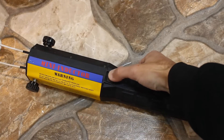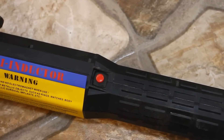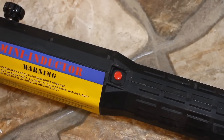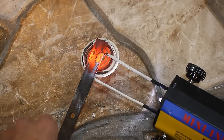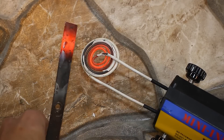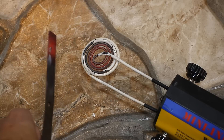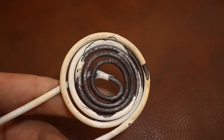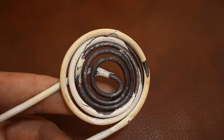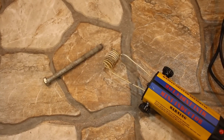The heater is activated by pressing a single button. It doesn't lock in place — once released, the device turns off. Important: due to the lack of water cooling, the inductor gets very hot during operation. After turning off the system, it takes some time for the inductor to cool down to a safe temperature. Therefore, you shouldn't touch the inductor even after it's turned off — there's a risk of getting burned.